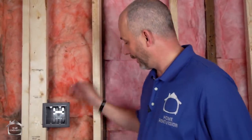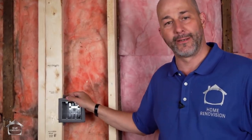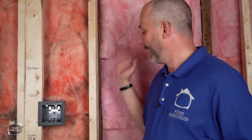In this situation we are actually going to be installing a door in this wall and this will be our entry point. What I have here is a box — it is a plastic box because it's going on the outside of a house, and in our area we use vapor barrier on the inside of our homes, so plastic boxes are really convenient because you can tape your box to the plastic. It also comes with a gasket on it front and back. It's an air seal as well, so it stops air from moving through the boxes in the electrical system, which is great.